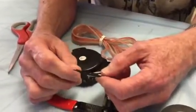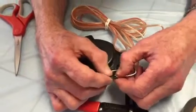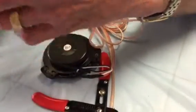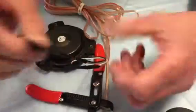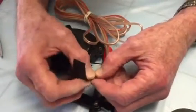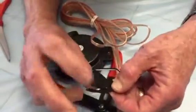Okay, now these are both individually wrapped. The next step is we're going to tape them together because we don't want the pull or the stress on the wire where they could come apart. This time I'm going to take about a two inch piece and start clearly down on the wires themselves. The electrical tape is making sure that the hot wire and the ground do not touch.